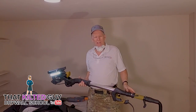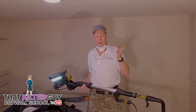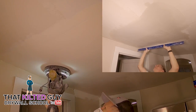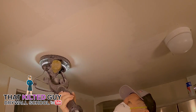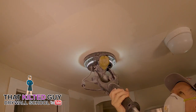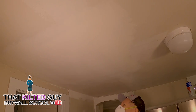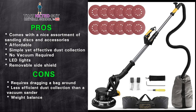If you saw any dust fall out, they all do that — just be aware of it. The real test is sanding the dry coated drywall mud areas. This is a big patch I did for a really bad ceiling repair. Some dust gets away if you don't hold these things tight to the ceiling — that was my fault. I tried 80 grit and it was too aggressive, it couldn't keep up, but once I switched to 150 or 220 it did fine — better than I expected.